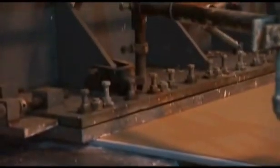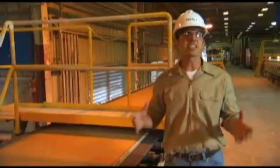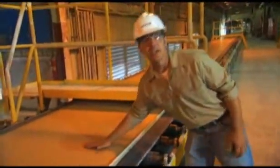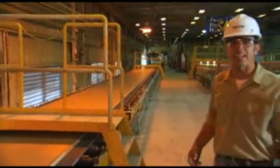This form extrudes the product to its final thickness. Before the stucco reacts with the added water, the board is soft. But by the time it gets to the end of this conveyor belt at 600 feet, it's hard enough to cut. That's one long piece of wallboard.